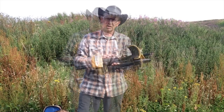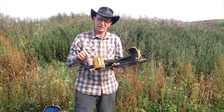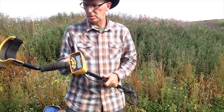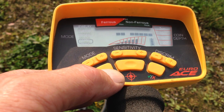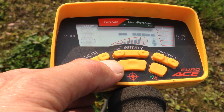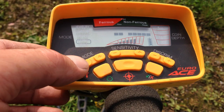Definitely a brilliant metal detector. Let's put it back together and see how easy the controls are on this superb machine — it's almost plug and play. Once your Garrett is set up, it should be at factory settings. Just to make sure, switch it on, let it settle, then press the power button and hold it for five seconds. When you hear that double tone, that's you back to factory settings — and it's always a good place to start. Then you can carry on and do your different modes including custom mode.